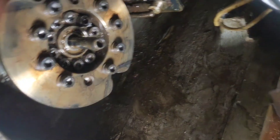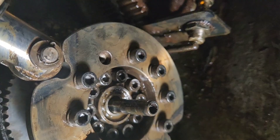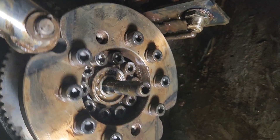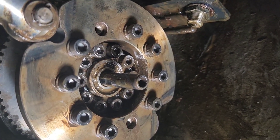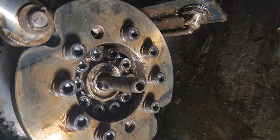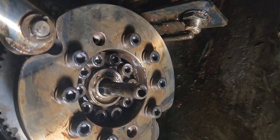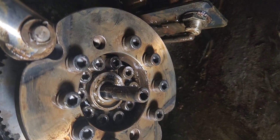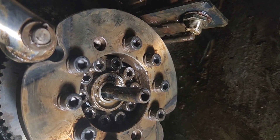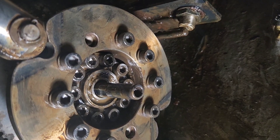Not only do you have to adjust that — there's a taper lock. That taper lock right there, and this detent right here: you need to loosen up that taper lock, and that will let you spin that live tool. If you orient the turret, it's going to go up to parameter 4077 at 2400. You can just loosen up that taper lock, spin the live tool with the wrench, and get it perfect. You don't have to mess with the parameters.